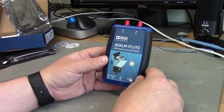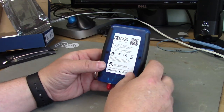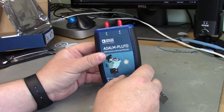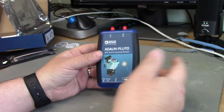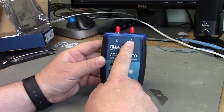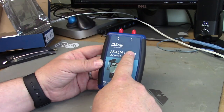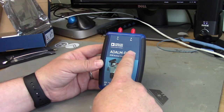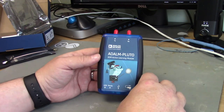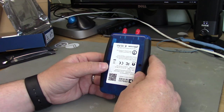There are a couple of LEDs inside and two screws to take it apart. This is a revision C board. If you're lucky enough to get revision C or above — which you will if you're buying this now — although there's only one transmit and one receive broken out to the outside case, on the inside there is a second transmit and a second receive port. The website notes that during manufacture they don't test those ports, but they are populated, and if you want to mess with the software you should be able to get access to them.